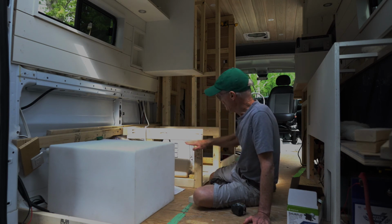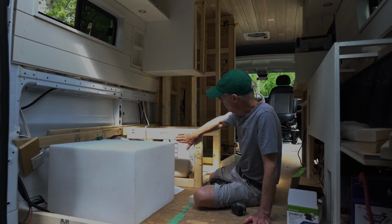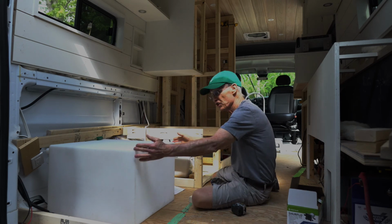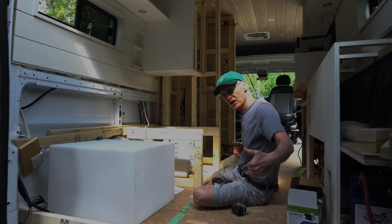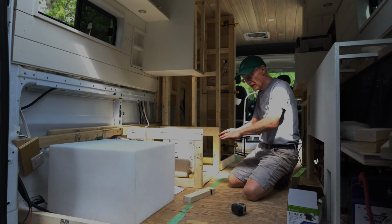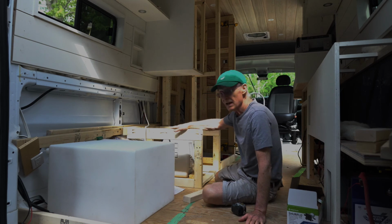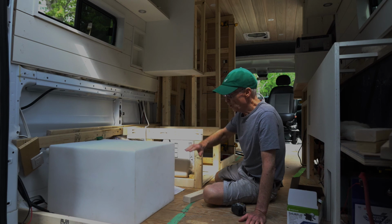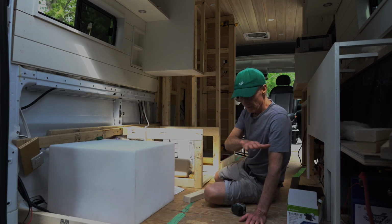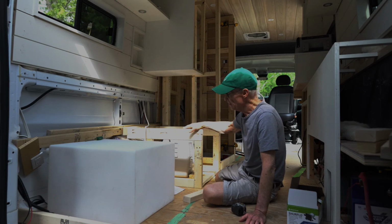Then what I'm going to do is mount heavy duty drawer slides, like 25-inch drawer slides, onto the supporting member here on both sides, so I could slide out a 25-inch section in this area and a 25-inch section in this area to make a second bed. So this is going to allow us to have a couch that we could use, and also allow it to be converted into a bed for 2 by sliding the lower section out for 1 bed and using the couch for this other bed.